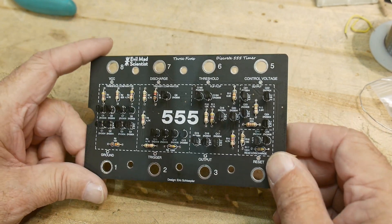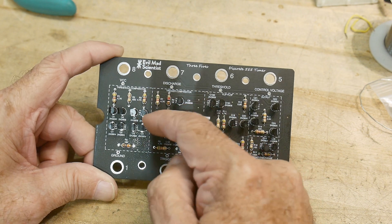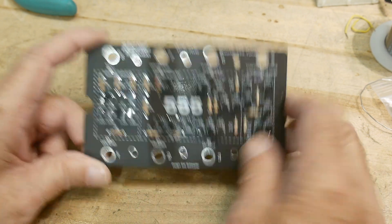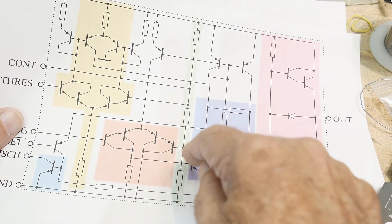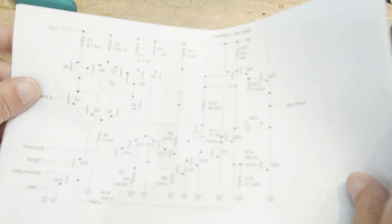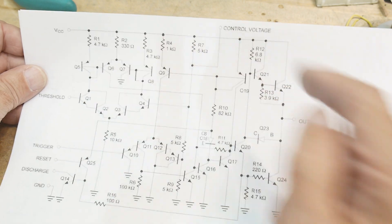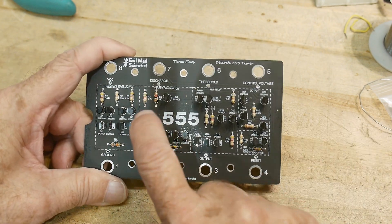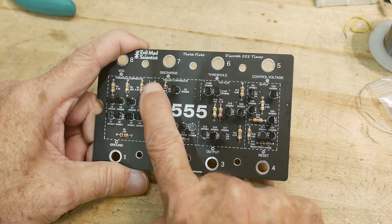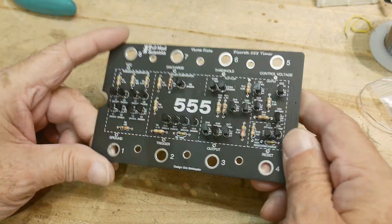When I was building it, this one, this one, and this one are the 5K, 5K, 5K — that's the two-thirds and one-third resistive divider that the 555 is famous for. If you look at the actual schematic from a datasheet, it has 5K, 5K, 5K. But other places it uses 4.7K, 4.7K. This board called out 4.7Ks everywhere, and I could not build it with 4.7K — it just would have bugged me. So I put in 5.1K, 5.1K, and 5.1K. That's the only change I made. It wouldn't matter — you could put in 10K, 10K, 10K, and I'm sure it would operate about the same.